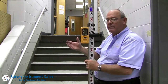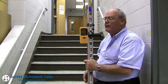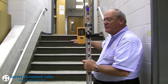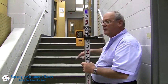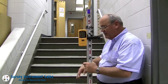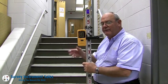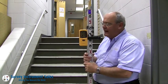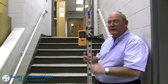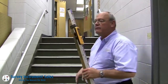I need to subtract 10 feet from my add to the rod to get the proper elevation. If I'm above my datum going up these steps, I would be adding 100 feet to whatever my rod reading is. Since this first step was at 100 and now I'm below elevation 100, I subtract 10 feet from my add — so I'm only going to add 90 feet to my rod reading because I went above the 10X. That's about it for this instrument.